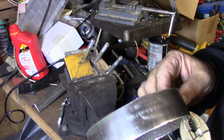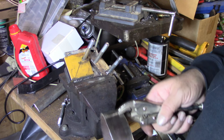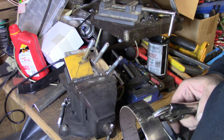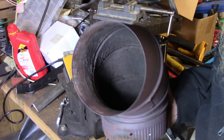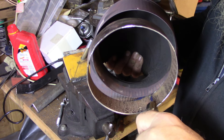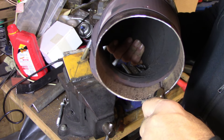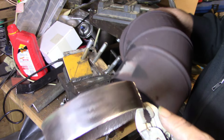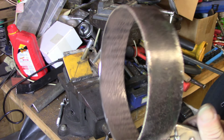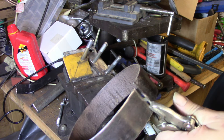I'm going to go out and give it a try in a second. Here's a chunk of the pipe that I'm going to be using — this is just an old piece, I'm going to get new — but yeah, she goes in there nice. It's going to be real nice in there. So I'm going to grab the welder and weld this seam up, and then we should be ready to cut a bigger hole in the top of the oil burner and weld this sucker in.